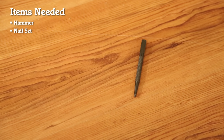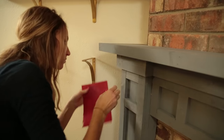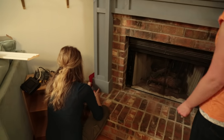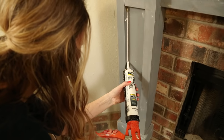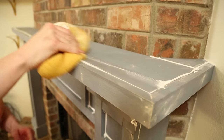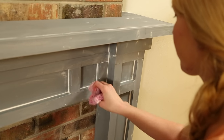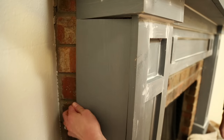Finally, we start the finishing details. We're going to use a hammer, nail set, caulk, putty, and sandpaper. We'll start with sanding the entire surface. A little extra time here assures the paint will stick and the finished product will look awesome. We're going to set all the nail heads below the surface using a hammer and nail set, then caulk all the joints and putty all the nail holes. Wiping the caulk with a damp sponge will make it smooth and minimize the cleanup. Hey Sheena, I love your idea of hiding the cords in this — now we just have to execute it.